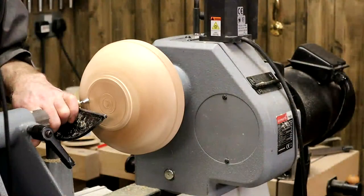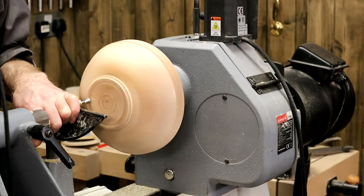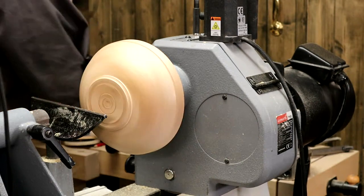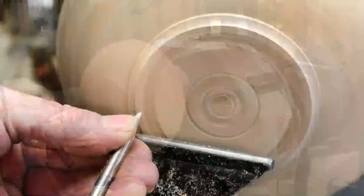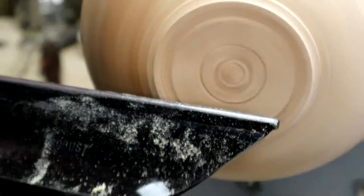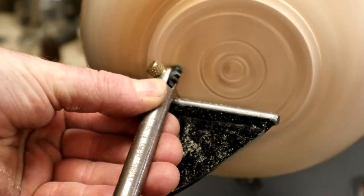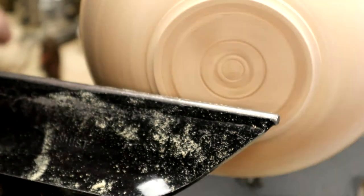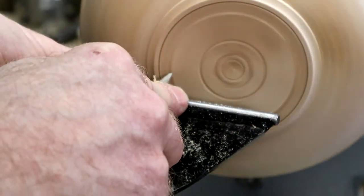We can maybe push this forward on the torus a little bit. Not expecting this to be as good on this because you've got that cross grain effect. I know with the crown tools, from when I've done stuff and looked at stuff, there's the advice that the direction of feed of the wood can affect what you're going to get. So you try and keep it squarer, to bring back into reality what we did last week. With the crown tool I would be square, not tilting to come across here, because you get that cross grain. Point tool, we could clean up those shoulders.